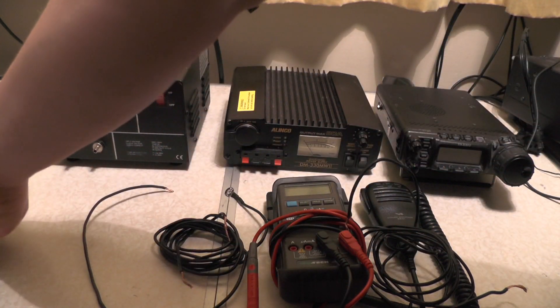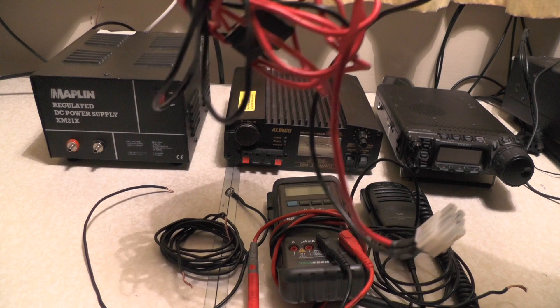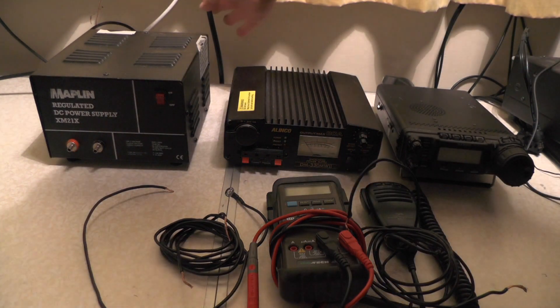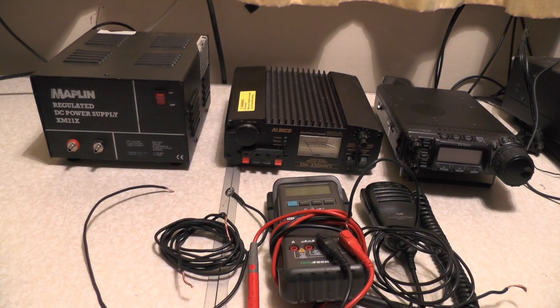So that's a good power lead, the other one was a good power lead. I then tried changing the power lead from the radio, thinking this was faulty, and I was still getting a shock. I then tried changing the coax over from big thick stuff to thin stuff, and I was still getting a shock, but I was getting less of a shock.